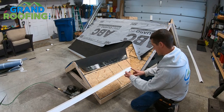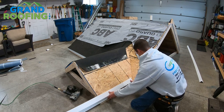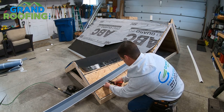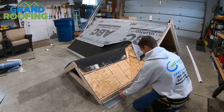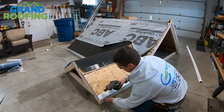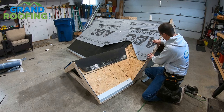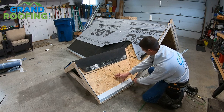If you were to roll this up, it's the same concept. What you're after is having a little bit of the face going this way so that when you bring your gable down, it can lap onto that. The other important thing is you're typically going to dry your roof in and then your apron, or your gable, covers over your paper. But in a case like this down here, you want to make sure you've got a small piece on first so your valley roll and ice and water crosses it.